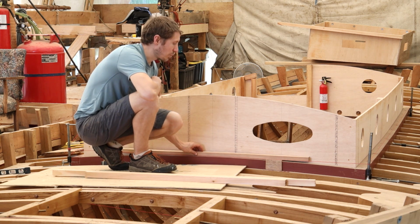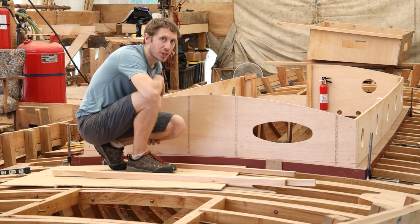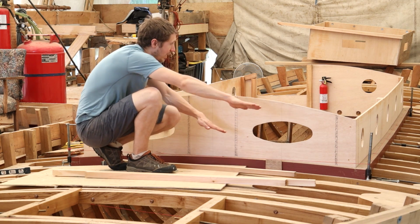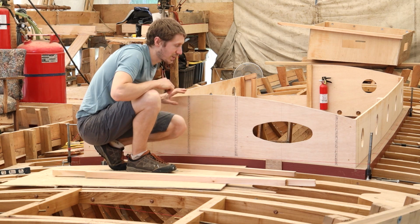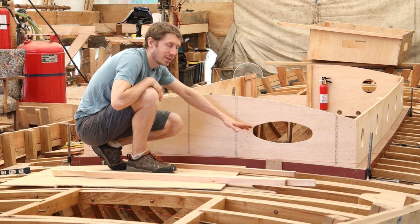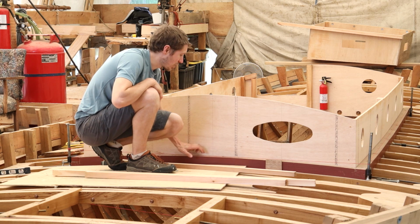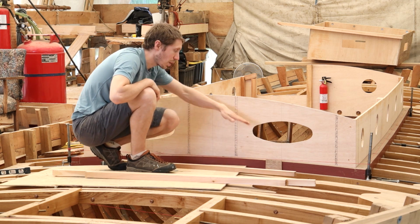Now, the trouble with this lamination over here is that we have a lot of shape to the deck. So the deck is cambered this way and it's cambered that way down the length of the boat. So we need to figure out how to get laminations to sit properly. So our plan is to lay a base layer that is gonna get us up to about level with the highest spot, which is here and down on the other side, because these camber up.